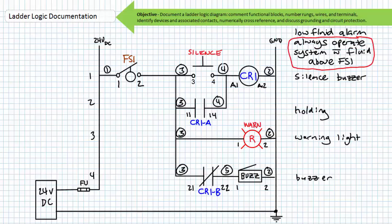Remember, the gravity convention dictates the switch's deactivated state. The schematic is drawn such that gravity would ordinarily pull the switch closed. However, it's being actuated into its activated open state by being immersed in liquid. It's for this reason that I ordinarily use the arrow convention that makes it explicit and obvious the normally closed float switch is being actuated into its activated open state. Don't walk into this tiger trap again. I guess I did teach you something in a twisted, devious sort of manner.